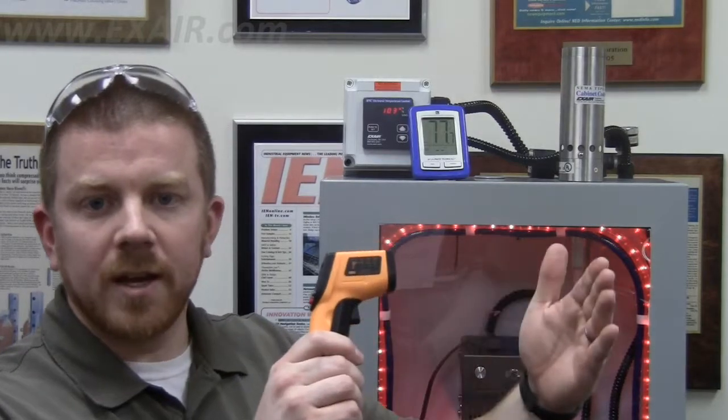This is different from what an IR temp gun does. An IR temp gun like this unit is going to measure a surface temperature over an area that is specified by the distance from the target. For this gun, when measuring from twelve inches away, it monitors a one and a half inch diameter circle of the surface. This again is a surface temperature rather than an air temperature.